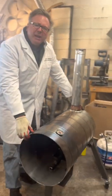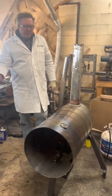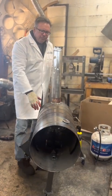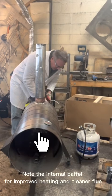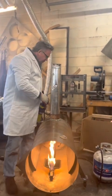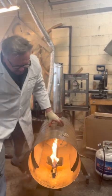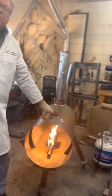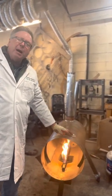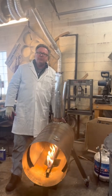It's a very simple device — it's on wheels and just slides right over the top of the engine. Let me show you what the flame looks like for the propane when it's on. I'll just use a little blowtorch here to get it started. You can adjust the intensity of the heat to a certain extent — high flame or low flame. It's much like a propane grill that you might use for cooking. There's a little thermometer up here that tells you the temperature the engine is seeing. And that's really the firebox — very simple device.